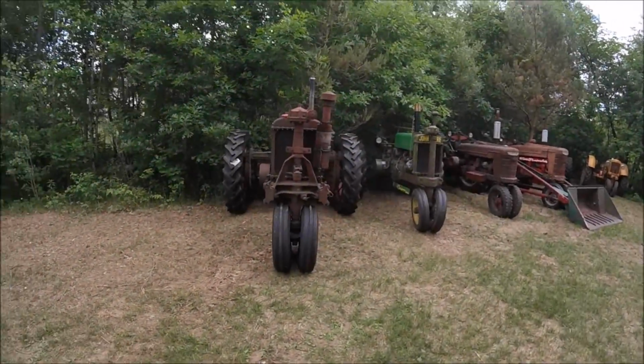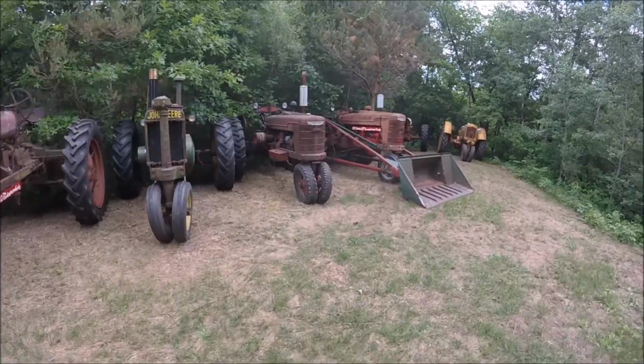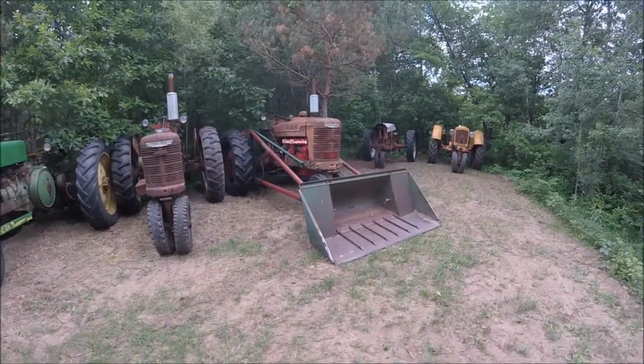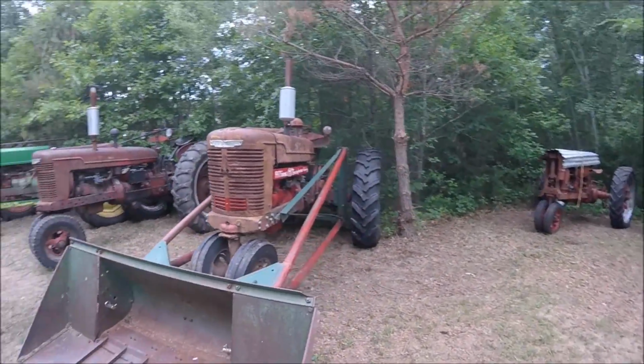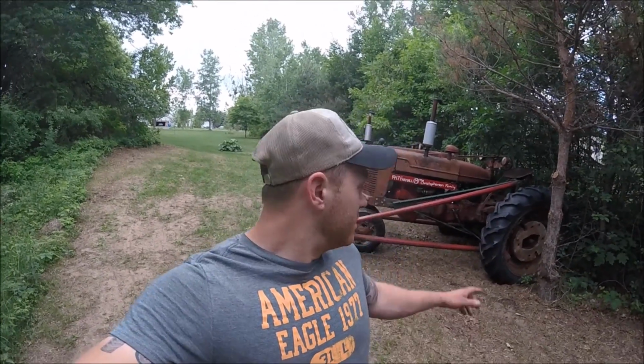So anyways, I just wanted to touch base with you guys and give you a nice little walk around of the tractors as I close out this video. I do apologize for not driving all the tractors in the same video, but I'll try to do that at some point this week. But I really want to get some video of the F20. I want to take the governor apart on that and clean it and see if we can't get it to function properly. And then on the Minneapolis as well, I got to take the crankcase cover off and probably scrub out the crankcase.